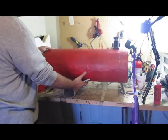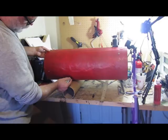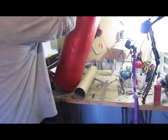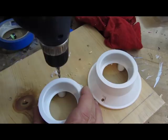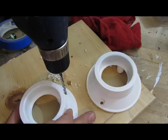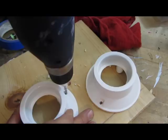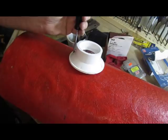Let's start on the tube. Let's put those mounts on your telescope tube. You need to find the center of balance of the telescope — put the mirror in it, put the eyepiece in it, get it to its full weight, and then balance it on some kind of cylindrical object, like a broomstick. Mark it there when it's balanced like a seesaw, because that's where we're going to mount these — they're called two-by-three inch general purpose straps.